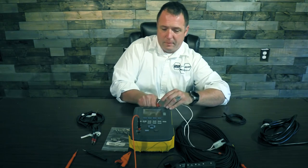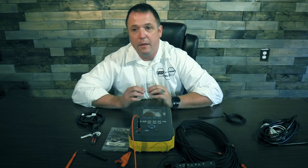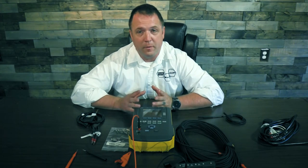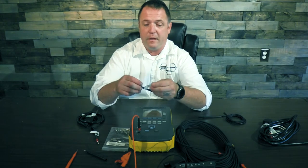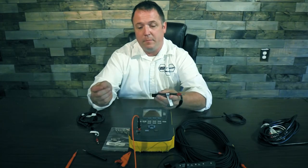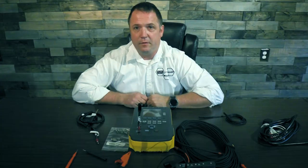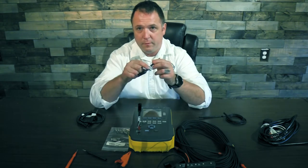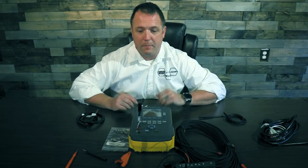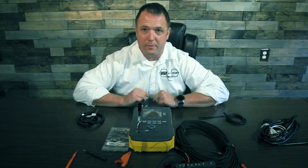Let's talk about ultrasound testing. We have the ULT-800 for testing T-probes or ultrasound probes, but the ULT-800 is a pass/fail device. If you need the exact leakage reading off a T-probe or ultrasound probe, there's the ESA-615 ultrasound adapter, part number 347-2633. It lets you connect the adapter plates from the ULT-800 or the dual conductivity probe, then connects to your safety analyzer. I recommend getting two — one for the adapter plate and one for the T-probe — so you can run an applied parts test to get the exact sink current and leakage.